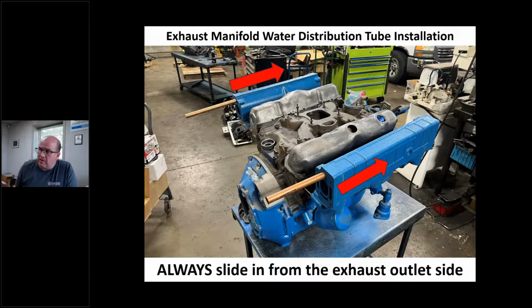Another tip on Chrysler is this thermostat housing. The water comes in right here from the front. It is so common to get an impeller blade stuck in that outlet that actually goes to this manifold, and you'll get one side that runs hotter than the other. And there's no temperature gauge on this manifold. The old engines in the 60s had 2 temp senders and reported to 1 gauge, but everything from 70, 71 and up doesn't have 2 senders that I've seen. So this manifold could be 240 degrees, and my water temp sender's up here. I'll never know it, right? That's why in the sea trial, I'm always putting my hands on these manifolds. I better be able to keep my hands on them on a non-catalyst engine, all right?